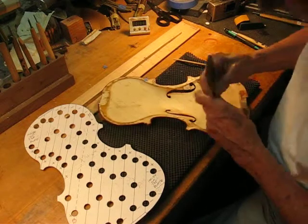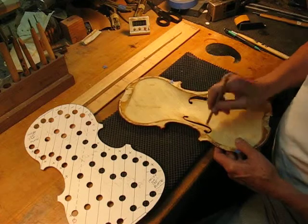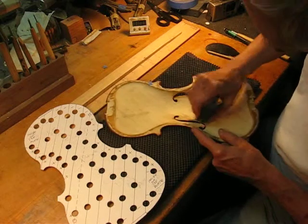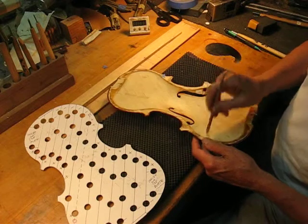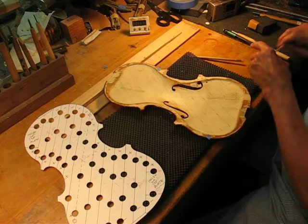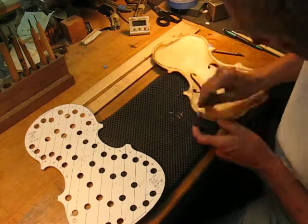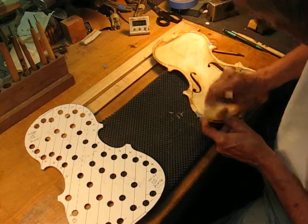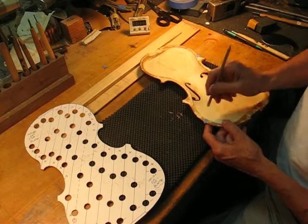Right next to the sound hole, it's still a bit high. You could use sandpaper here too if we're concerned about that — it isn't too close to the edge. Right near the very outside edge, it's a bit higher. I'm going to support it again on the pad. We have our little reference tape here so I don't want to get disoriented. Our goal to start with is just to make this even all the way across.